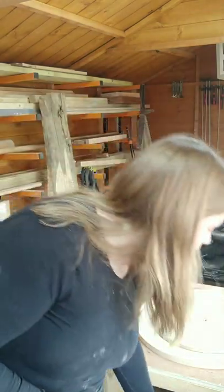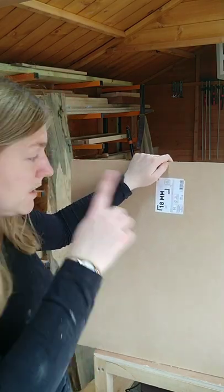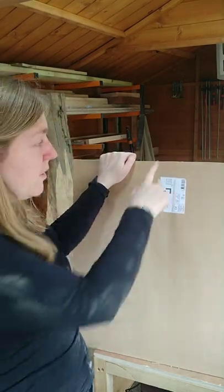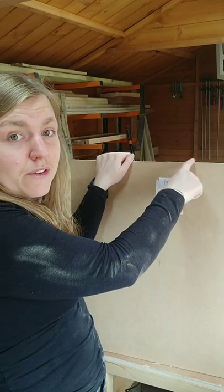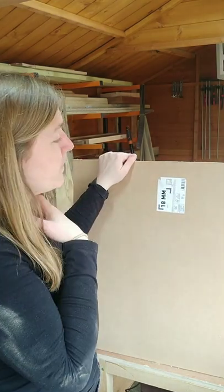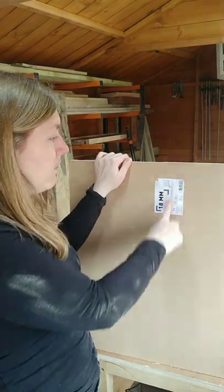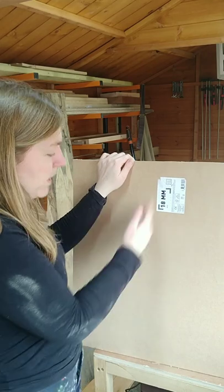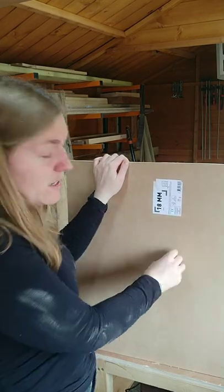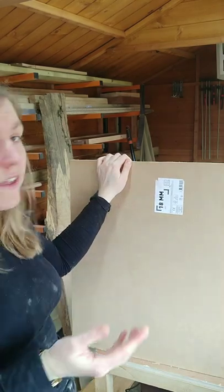So this video, I thought I would do one from scratch again. So the bigger size, this will be almost another 60 centimeter diameter stretcher. And then do all the things differently. So bring it in a bit so the router doesn't have a massive change in resistance and spin off like it did last time. And do about 8 centimeters, and then I'll stretch up and see if that's any better. Route out the recess bit, and then we'll see if we can get some concentric ones going down smaller and just bash it out. Once I've bolted it into the middle of this one, I might as well just keep it bolted in and do them all in one go and see how long that takes me.